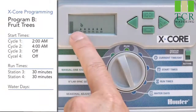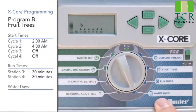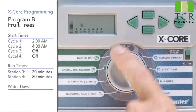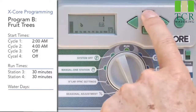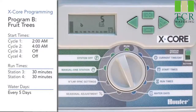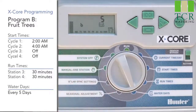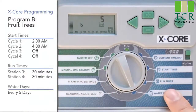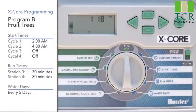We've got seven days a week showing across the bottom, but we want program B to be on an interval, so we'll hit the left arrow and it shows a big number at the top of the screen. Use the plus button to go up to 5, which means it's watering every five days on program B. You'll see the letter B here still, so now B has all three ingredients also. When you're finished with B, put the dial back to the run position and you have two separate watering programs.